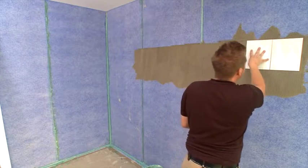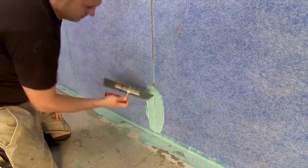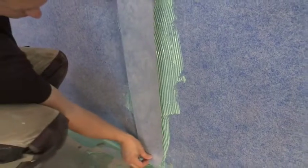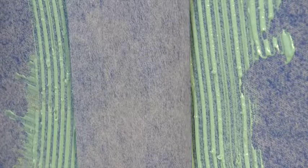It is recommended that seam tape be used for commercial or high-traffic environments. Abut the sealing membranes. Install the sealing tape over the seam. It should be wide enough to provide approximately 2 inches of overlap on both sides of the seam.